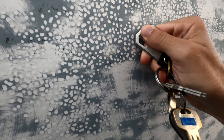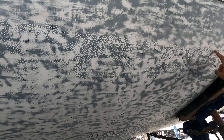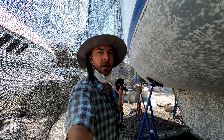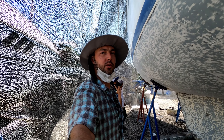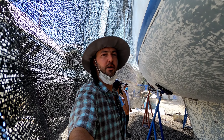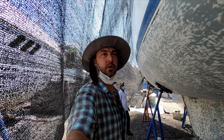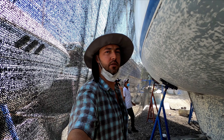This is my opportunity to try and get ahead on as many things as possible before that huge Pacific crossing. You can see that it's wet — see the water? We have to peel to the fiber and then apply new gel coat. I'm here right now with the owner of the boatyard, talking about the bottom and the blistering and making sure we do it right. It looks like it's going to cost me more money, but I'd rather do it right. Otherwise, why do it at all? We're going to get a consultant here who's an expert on this, and hopefully they can recommend the exact course of action.